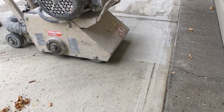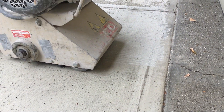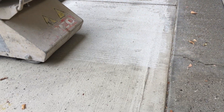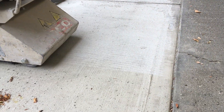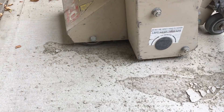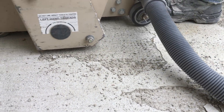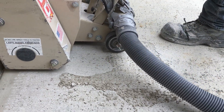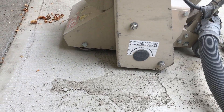These scarifier machines are great for that eighth of an inch to quarter inch surface-level damage. They're great for removing old overlays or old coatings — that's what's happening here. Grinders are just going to skim on top of that and they're not going to actually remove it without a ton of work and burning through a lot of your diamond blades. Whereas these scarifying machines really hammer on the surface and break off these old loose deteriorated surfaces in chunks, so they're better for more heavy abrasion and removal.